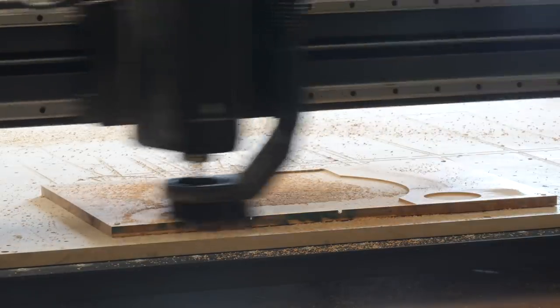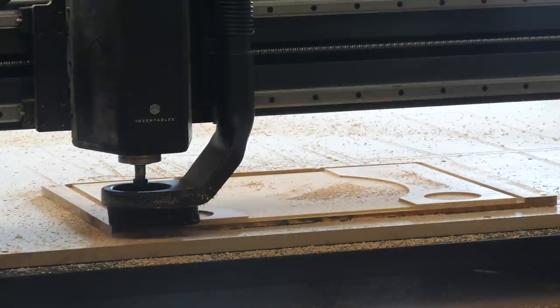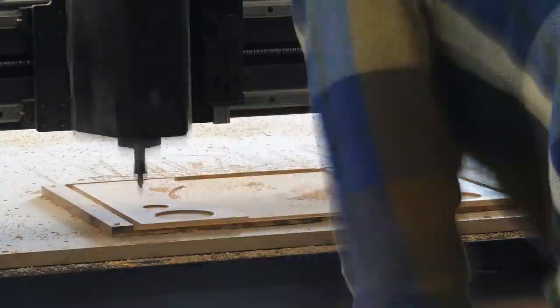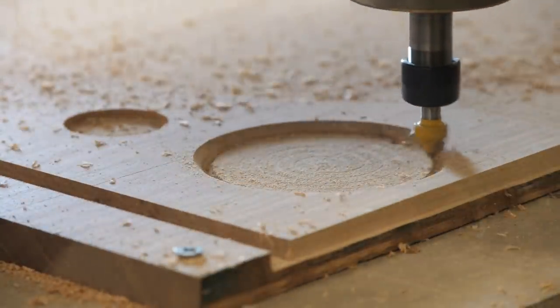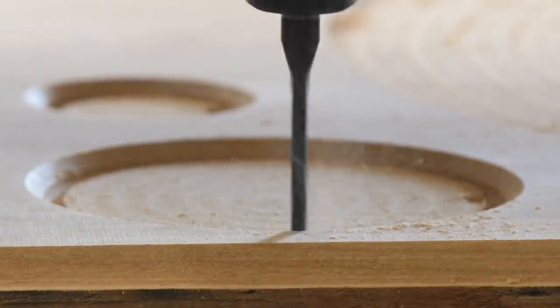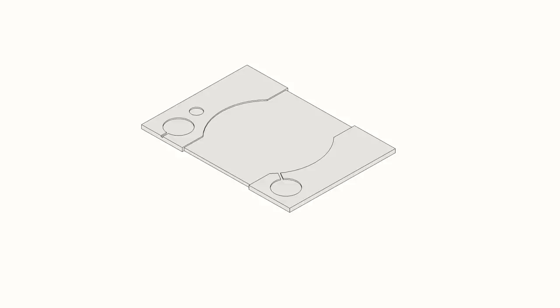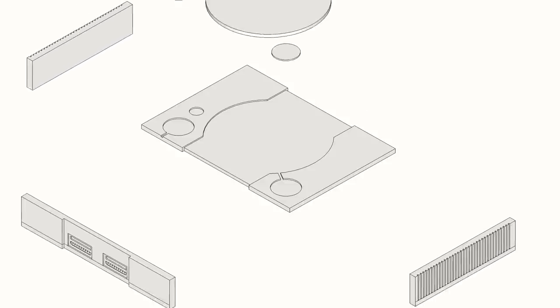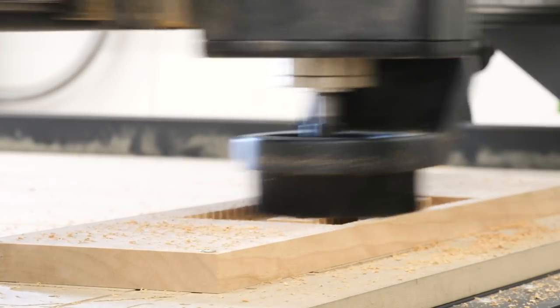We didn't want to start celebrating too soon because there's still a ton of work to do. That started with changing out the quarter inch bit for a chamfer bit so that we could cut this little detail in on the button area. Then changing out the chamfer bit for an eighth inch bit so that we could cut in these little groove details. After doing that, we finally had the first piece of the puzzle completed. Granted it's the largest piece, but there are still seven others that we have to make, which are all pretty similar from a workflow point of view, and then there's going to be a fair amount of assembly and handwork still to do as well.